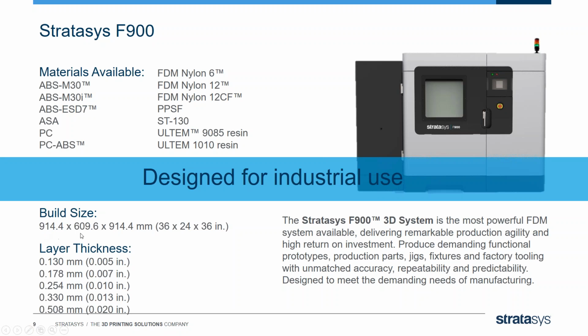That's why this machine is 900 by 600 by 900 millimeters. And we have 5 different layer thicknesses, starting with 0.13 to 0.178, 0.254, 0.33, and with the G40, you can run 0.5 millimeter layers here to be very, very fast with your materials.